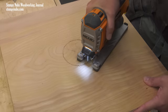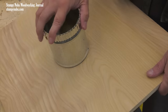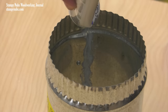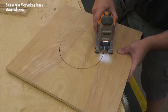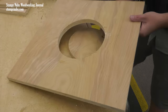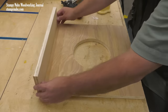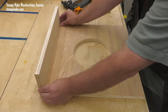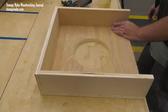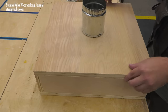In the center of one of the large squares, I cut a hole to fit my 4-inch duct collar fitting, which is secured with some screws and sealed with silicone. Don't forget to seal the metal seam. In the center of the other large square, I cut an 8-inch hole. Then I begin assembling the box sides upon it. The 18-inch long piece goes on the back edge, and the two 17 and a quarter inch long pieces go along the sides, while the remaining large panel goes on top with its 4-inch collar pointing upward.